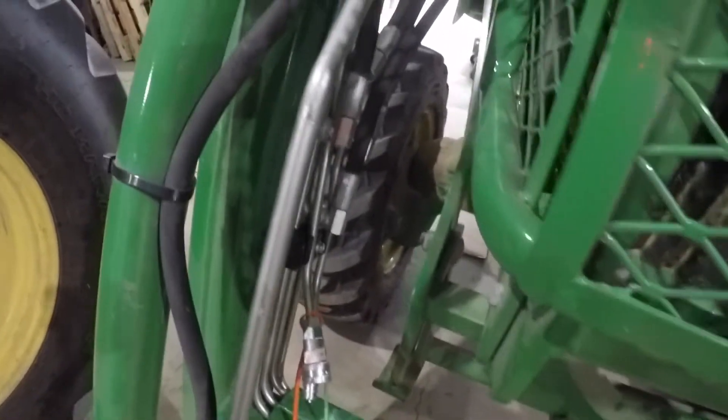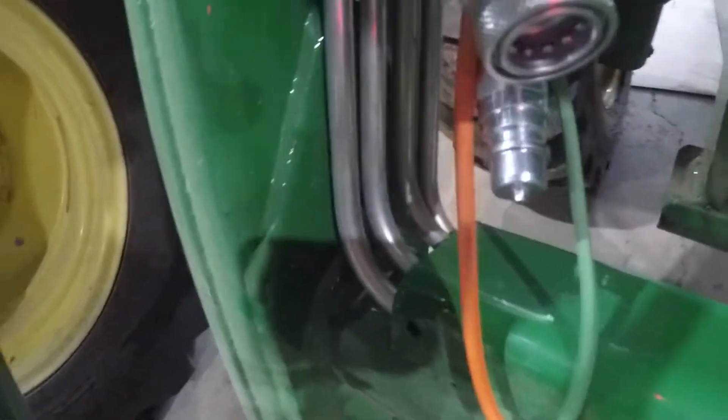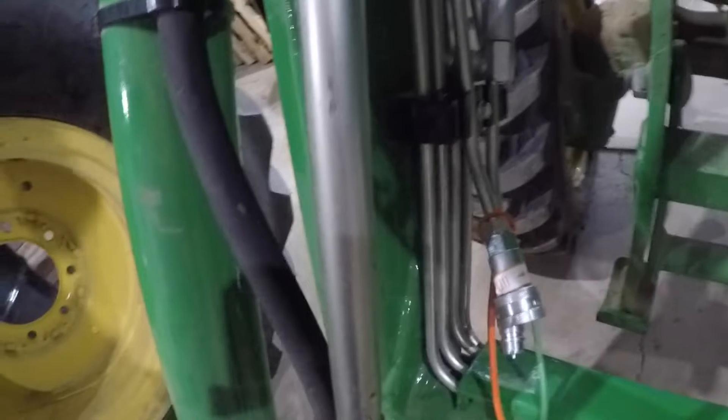This is the front hydraulics — I've put it on. It's too hard to show every little step, but you can see the front hydraulics have a male and a female plug-in for the hoses that would go off a grapple or a cylinder off of a snowblower. I added this bracket that came with the kit and ran it all through there. I had to tweak this tubing a little bit so it wasn't rubbing on anything.